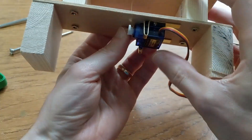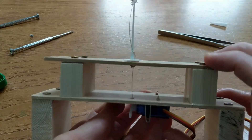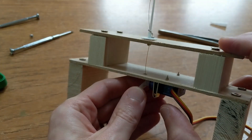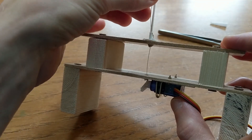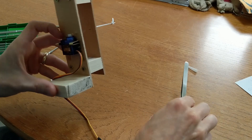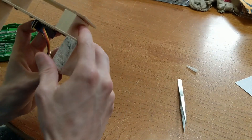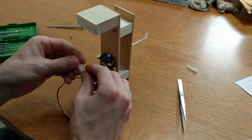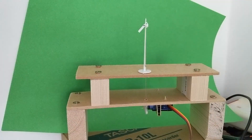That still just about fitted onto the servo arm, but in trying to fiddle with its position I seemed to activate the servo a bit and it moved several degrees beyond where I wanted it. The brass rods absorbed the strain and nothing got broken. I did then add an extra bend to the rod connecting to the servo. Once it was connected back up to the computer the rotation values I'd put in before were all wrong because the servo had moved, so it took a bit more fine tuning to get the right range of motion.